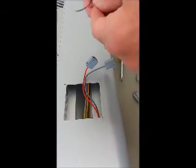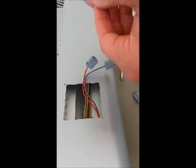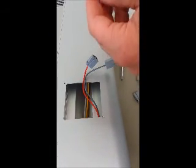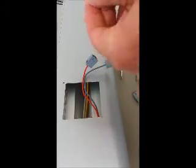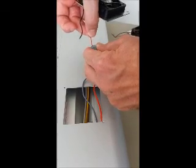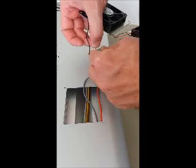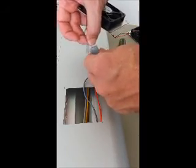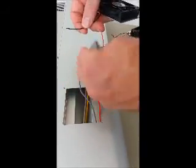I'm going to make sure that I match up the red wire to the red or orange wire inside the fixture itself. Just make sure the wire is in good shape and nicely stripped. Then pinch, gently insert the wire, and give it a quick tug to make sure it's making a good connection. Repeat for the black wire as well.